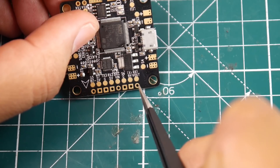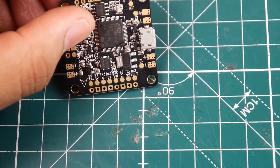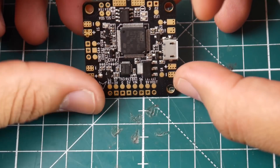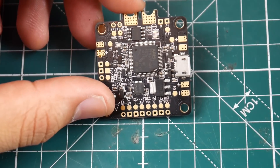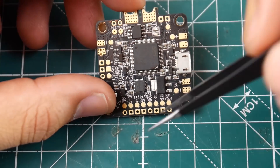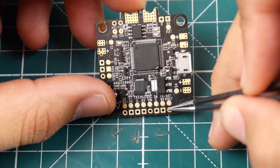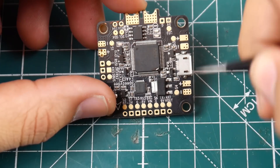They also give you ground, 9-volt, and video out for the VTX — that 9-volt regulator I love. From now on, when I look for an all-in-one or standalone flight controller, I will be looking for that 9-volt regulator because it makes all the difference and gives you beautiful video feed. Just note it doesn't automatically clean your quad — you still need to tune out noise — but overall the video feed is super clean. We also have TX1 and RX1 for UART1, and motor 6 input.